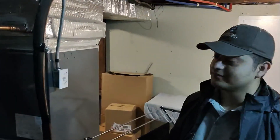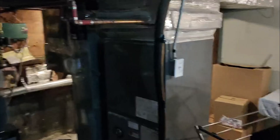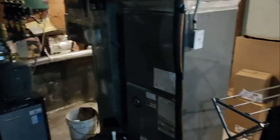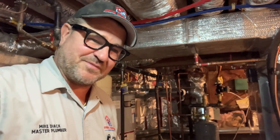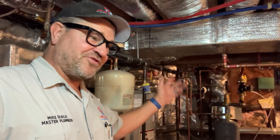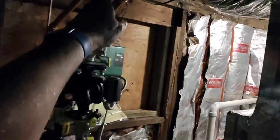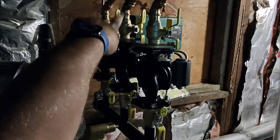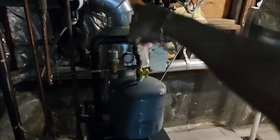There's a reason for everything I say. If you turn on one thermostat, you know exactly what thermostat that is and what area of the house it controls. Now you have two zones on and you want to make sure every zone is working independently. Go turn off one of those thermostats, remember which one is still on, and we will check the heat in that particular zone. A good technician is observant of his surroundings — by turning on multiple thermostats you're unable to test zone by zone. Zone two is running: this pipe is lukewarm, this one is hot, this one is also lukewarm.